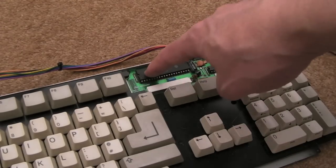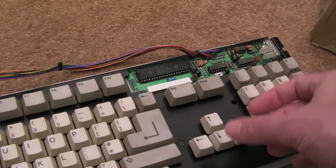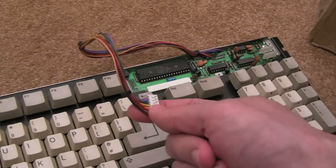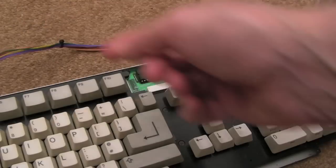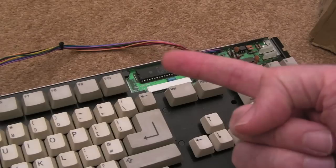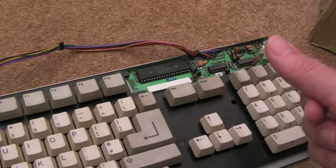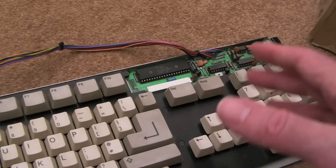The original PCB has changed as well — I think at some point this PCB was swapped for another because the MCU was playing up, including fixes to the membrane. One of the things that's different with the A2000 keyboard interface: the reset signal doesn't go across the connector. One of the connections on an A500 is the Ctrl-Amiga-Amiga reset — when you hold those three keys down it sends a pulse so the A500 knows to reset. On the A2000 that doesn't work; you've got four connections: VCC five volts, ground, keyboard data, and keyboard clock.